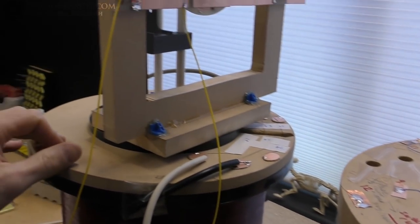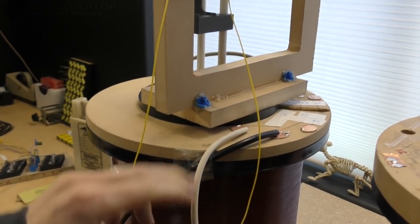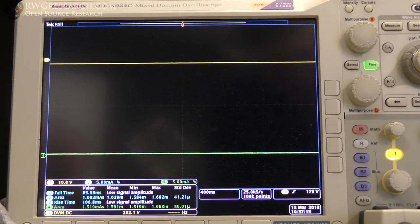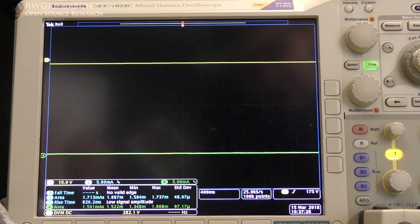The tests will show how much the inside coil cancels the magnetic field of the magnet from inducing into the outside coil, and how much induction we get from the inside coil when we charge the outside coil. This coil has three windings; two are identical — inner and outer. The inner has a lot more turns than the outer, but the same length of wire. We are going to charge coil number two — the outside one — and leave coil number one open.